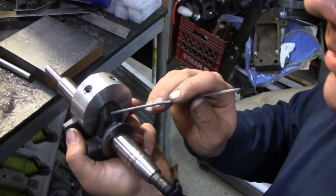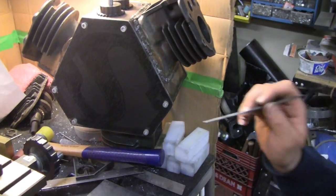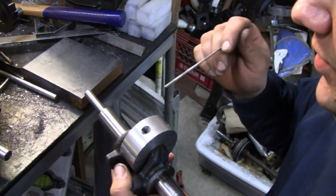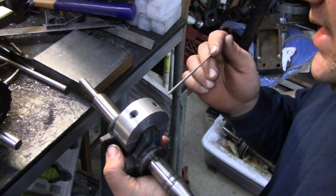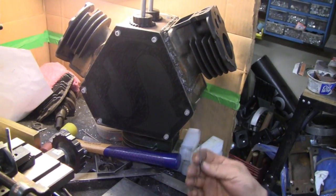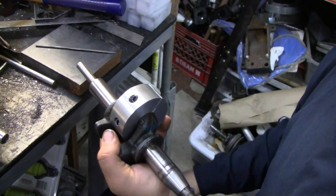It would be drilled here with a little funnel shape running into this side of the bearing, and then another one on the opposite side feeding the top shell. Maybe an oil groove cut on the bottom bearing shell. There are going to be three or four nozzles in the crankcase itself - one spraying oil on each cylinder and one at the rod hub. Depending on the volume we get out of the gear pump we built, we could have a nozzle at each upper piston, or one at the top with a Y fitting, and one directly at the master rod hub for lubrication.